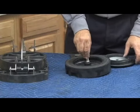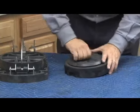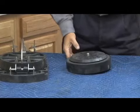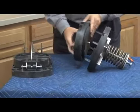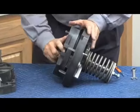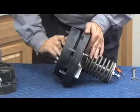First check, you'll be putting this bolt back in. This plate, which is on there for strength. Go ahead and tighten the disc retainer. Have that very tight. Go ahead and get our spring mechanism, which still has the spring contained in it. We're going to tighten up to get that very tight.